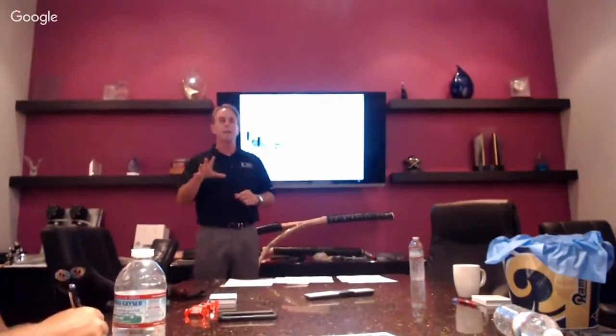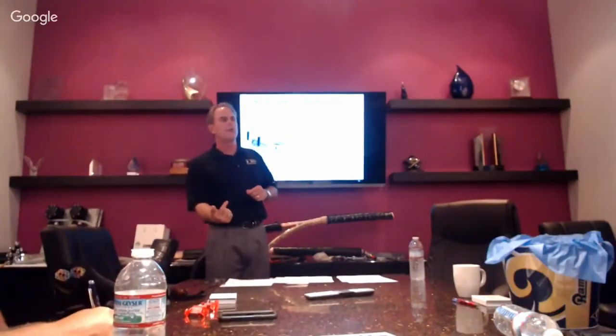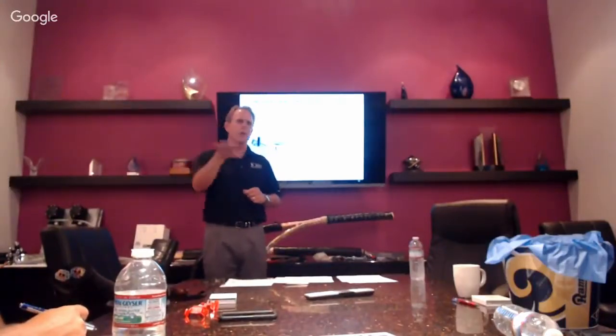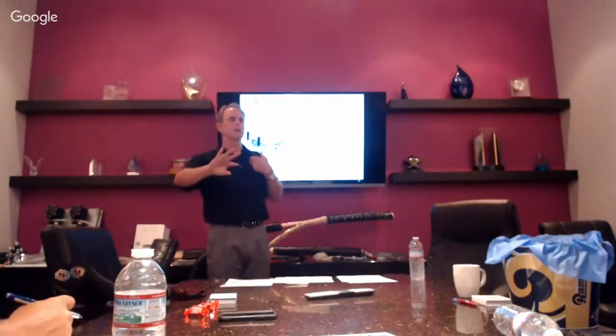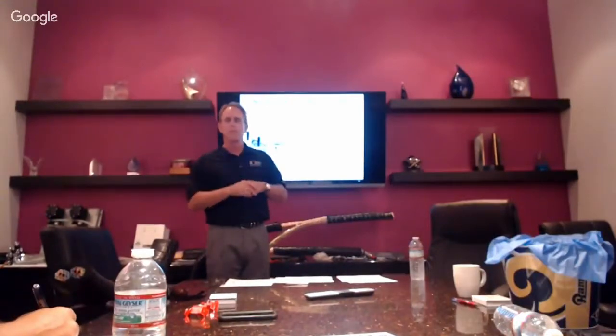The chimney is one of the biggest things, because more jobs than not, from what I've been involved with, the trunk bundle comes up in the floor and it's mounted on the face of the die wall, not in the die wall. And so often when you look at an elevation, there's just equipment all the way across and there's no chimney put in there. Well, from a sales standpoint, I should see that really early on. And if I don't, shame on me. Designers should look and recognize the same thing. And if it's mounting on the surface of that die wall and you got a bottle cooler, you can make it work, but the bottle cooler is going to be sticking out about 4 inches now.